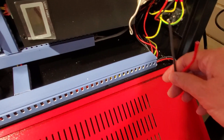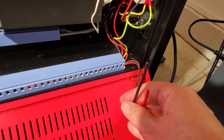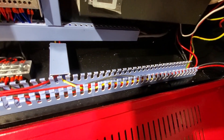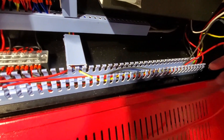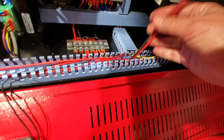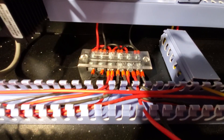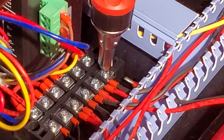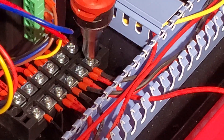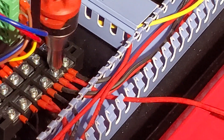Now at the door on the right side, you can see the cut ends. I have to remove the top of this wire channel. It turned out these wires were easier to remove from the channel, and it was easy to trace them back to the places where they connected into the wire block connector. You can just pull that clear plastic cover off of the block connector — each of these has two wires: one is the power coming in and the ground going out from the machine, and then the two from the fan are the ones we want to pull out. So you just loosen those screws, gently pull the wires out, tighten the screws back down, put the clear plastic cap back on, and the top back on the wire channel.